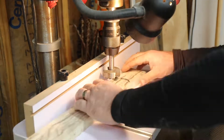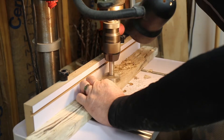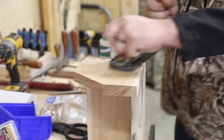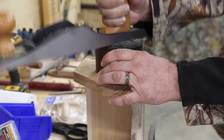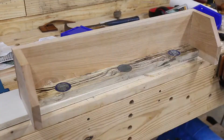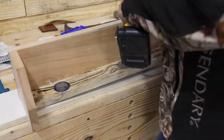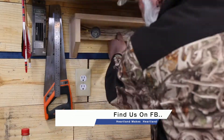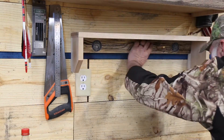While the glue is drying on the dovetail jig, I've got another scrap piece of wood — this is possum oak that I got off the property, ran it through my sawmill, and it's been drying for almost a year. We're going to take it over to the drill press and drill some shallow holes so we have room for the coins. I didn't have any epoxy, so I used the super thick CA glue from Rockler, got them all set up where they're sitting right, then sprayed a little bit of accelerant on the piece. Since that CA glue is so thick, I kind of globbed it on and spread it across the entire face to give it a little more protection, then sprayed it with accelerant again so everything should hold and shouldn't fall out.